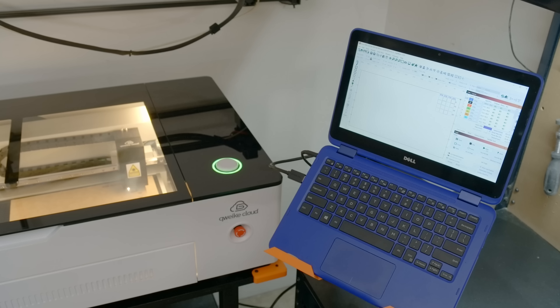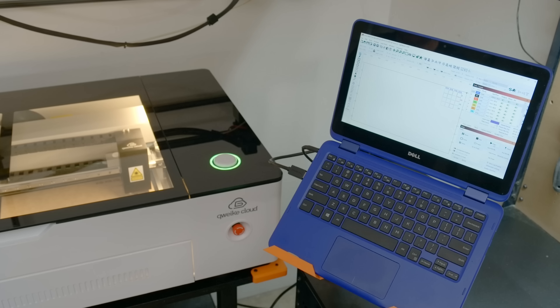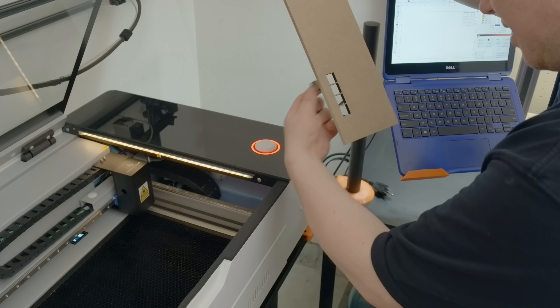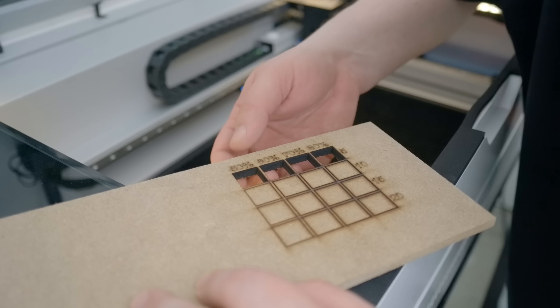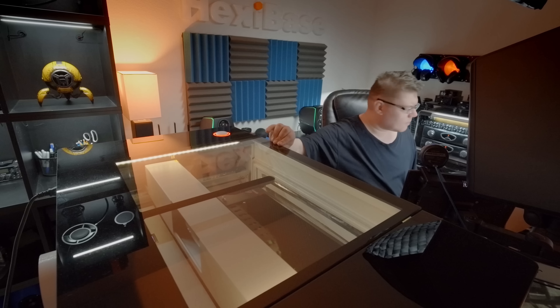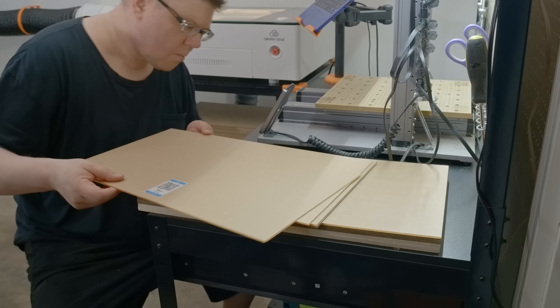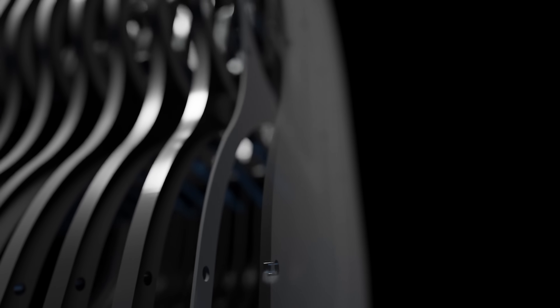I've prepared a test running the laser between 50 and 80% power, with travel speeds between 5 and 20 millimeters per second. The results are impressive — even at half power the laser punches through in a single pass. At a quarter-inch, or 6.35 millimeters per layer, I can achieve my target cross-section in only 13 layers. And acrylic samples from the included pack can become the outer walls for a see-through aesthetic, with gaskets on either side to help seal the waveguide.